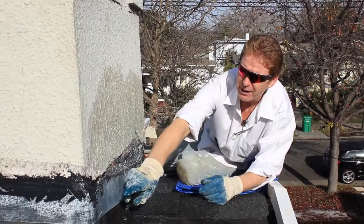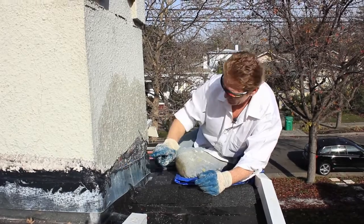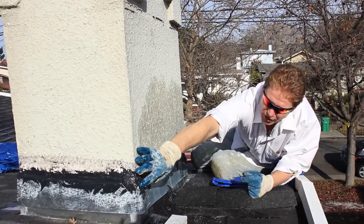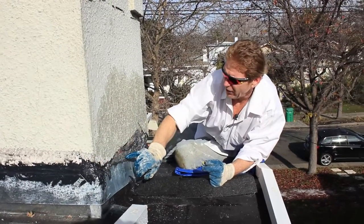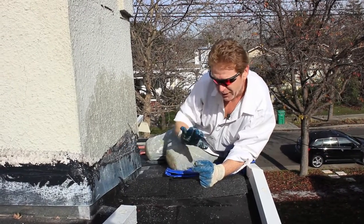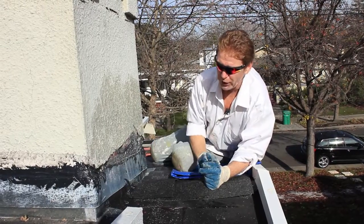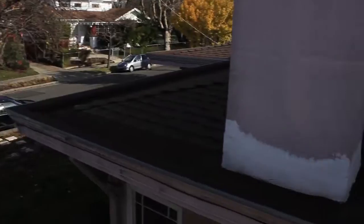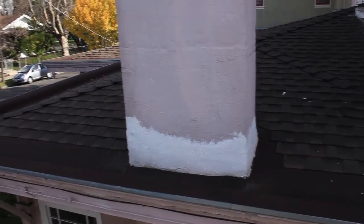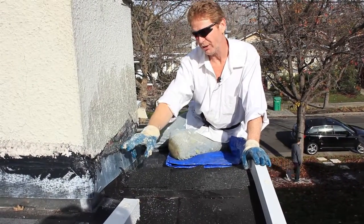So what they did is they came back and they put this flash in here and this one, and they notched a groove into the grout, and they shoved this L flashing into the groove. Back here, I can see they used a polyurethane caulking, more than likely a Sikaflex. And over here, I see they used like a Henry's. So I'm not certain about the Henry's. See, we're not supposed to, technically, stucco over metal or wood. Now, if you look at that chimney there, they took the stucco all the way down. I'm not certain what they got there or why, but generally you should have some kind of flashing like this, and it should go in the grout, and whatever you use to seal it, that's your business.